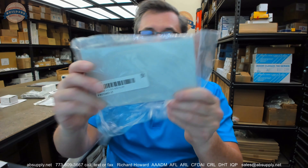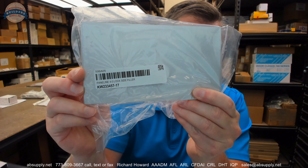So this is the filler plate for a panel line exit device. Obviously it would look like this — just showing you the label. The part number is 233457. This has a dash-17 after it because it is in the clear aluminum finish. The codes by Kawneer are dash-17 for clear anodized aluminum, dash-29 for black, dash-40 for dark bronze. So this is what the lock side or latch side filler plate looks like.